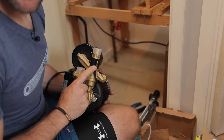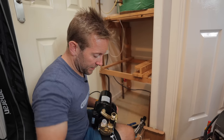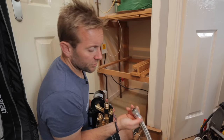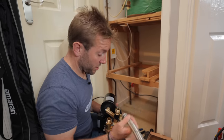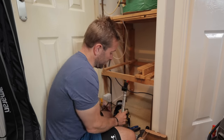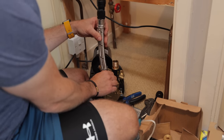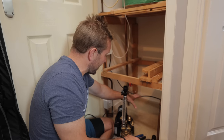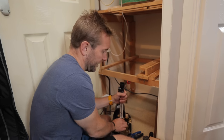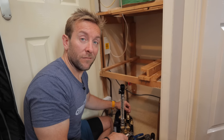So we've got an in and an out — there's an arrow on here indicating the outlet. Always make sure the rubbers are in there before you do any work, just to make sure you don't have any massive problems. While the pump is out, get the flexis in and nip them up — they're on rubbers so you don't need to tighten them up like mad. We're going to try to pop the pump around the side there, but if I get even slightly annoyed with the position I'm putting it in the middle — I don't care, it's not my house.